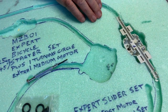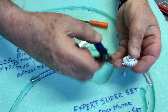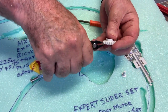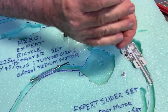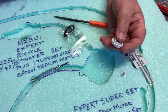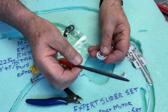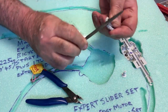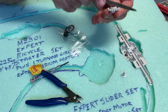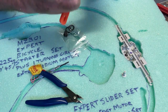As you can see, they fit snugly. The curves on the side — you've got to allow a bit more room because the cogs on the gears need that extra clearance. Make sure you remove all the sprue that's there, especially the one on top. The number of times people have said they hear a clicking noise — well, that's the bits of sprue you haven't cleaned off. Make sure it's perfectly clean.